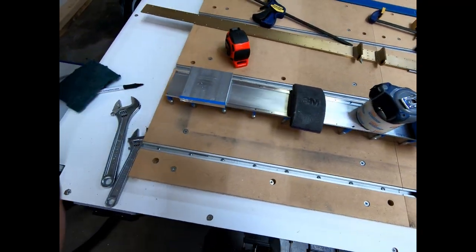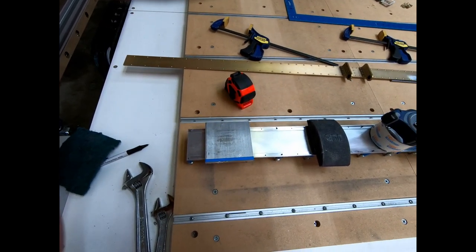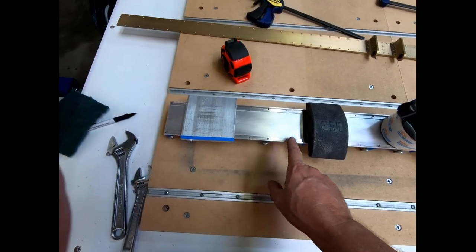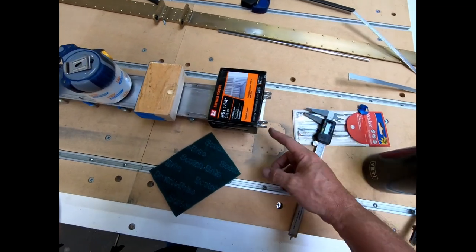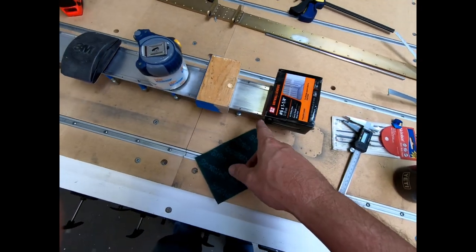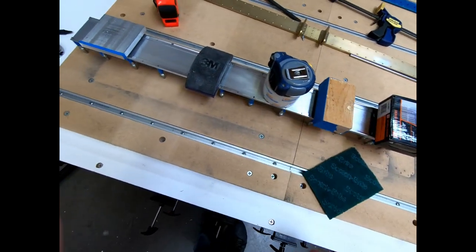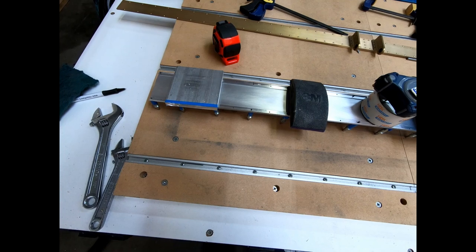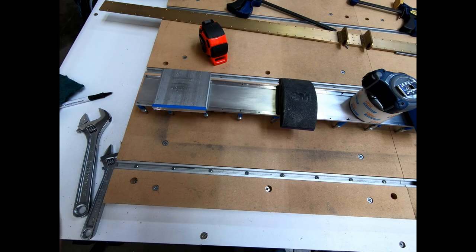I didn't use the method that we used on the horizontal tail or the elevator, which, you know, we screwed down between a couple boards. And part of the reason for that is that I final drilled all these holes to the actual rivet size in order to make sure that I could align the ends here properly with the pin and the bearings and all of that. So what I did is I just epoxied these onto the web, and I used the temporary sheet metal fasteners to just hold it in place. And then what I'm going to do is, just before the epoxy hardens, I'll take those sheet metal fasteners out one at a time and just clean them, because otherwise I'll end up with those being epoxied in.